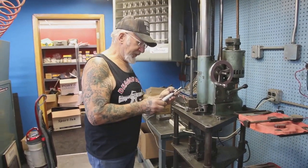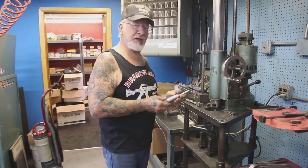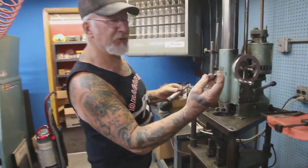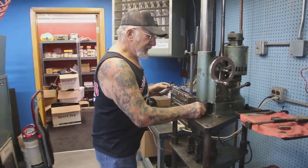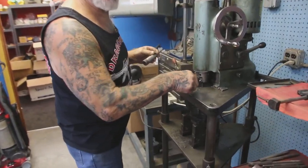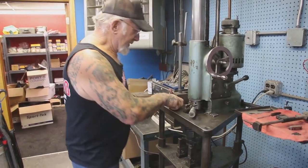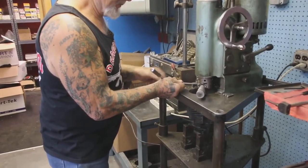We set the micrometer to 3.5 inches. That's a standard 80 cubic inch. We take the cutter, which is our carbide, and this here is spring loaded. See that? Okay, we put that in there. Okay, we take the little brush, make sure there's no metal filings in here or else we get the wrong reading. And now we stick in the micrometer. Okay, we tighten up the carbide tip.